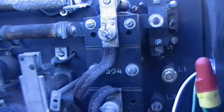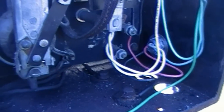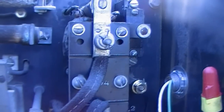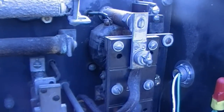This relay acts kind of like a transfer switch, like you'd expect on any modern day emergency generator setup. You've got these leads here, which are connected back there to each other. One pole down there, and the other up here. Right now, with normal power feeding, sorry about the wind, that buzz you hear is the coil holding this side of the contact closed.